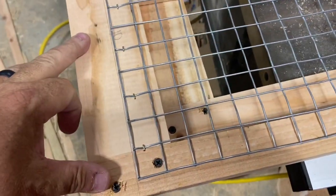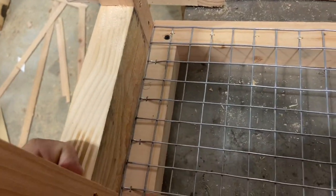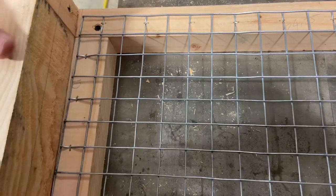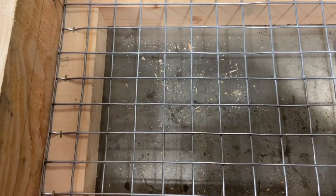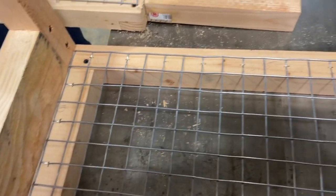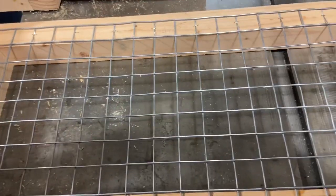The reason for staying an inch and a half back is because this is going to get bolted together — there'll be the front and the rear coming in. The back piece and the front piece will sit like this, so you need room for that wire. It's much better to have wood-to-wood connection than to have the wire sandwiched between the wood connection. That's why you've got to stay back an inch and a half from the edge on both sides before putting your wire on.